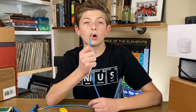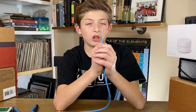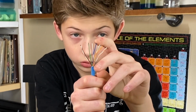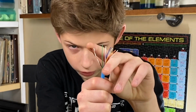In this video, I'll be following the T568B scheme. That means that I will arrange the wires in the following order: white orange, orange, white green, blue, white blue, green, white brown, brown.